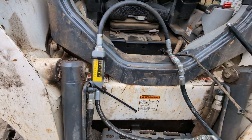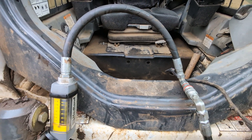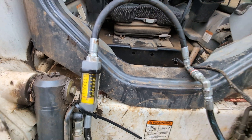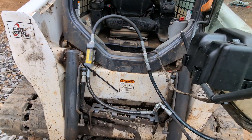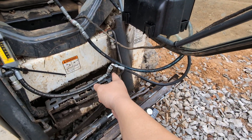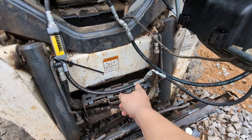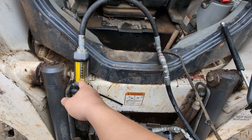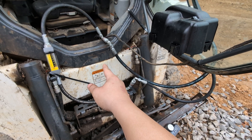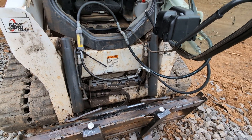As you can see, we can very handily handle 15 gallons a minute. There are two of these quarter-inch quick couplers in this setup, so the flow doesn't just pass through one — it goes through the hydraulic flow meter and out the other. Both couplers are handling this, even though they're said to only be good for six gallons a minute.